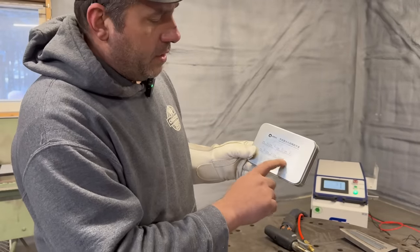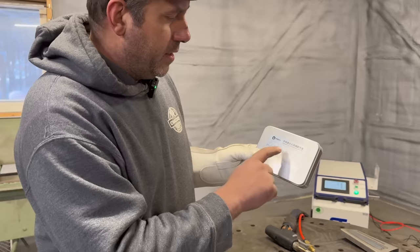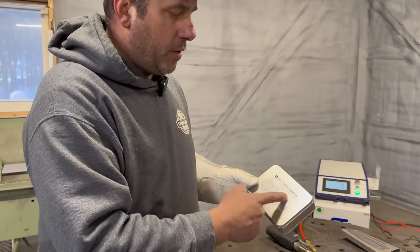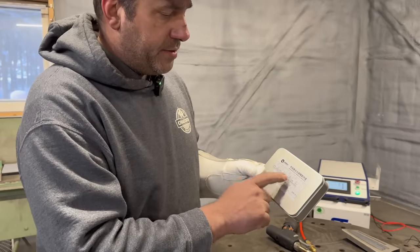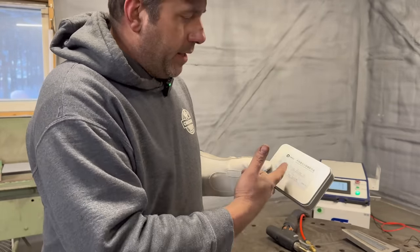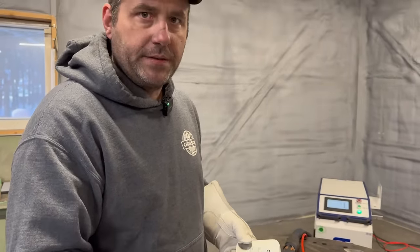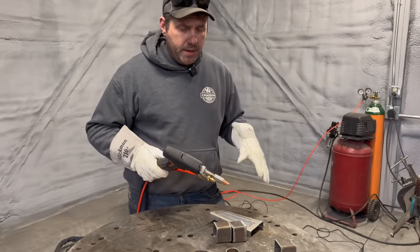It comes with a few sets of different tips. There's a laser cutting tip you can put on here. The tips are for different wire sizes — in this case we're using .035, but you can go all the way up to .052 or even a sixteenth-inch wire. There are also tips for outside corners and even for running dual wire if you're doing a large fill pass on an outside corner.